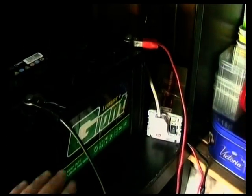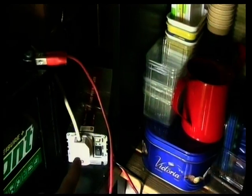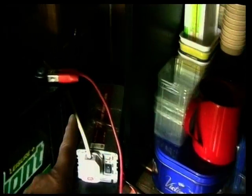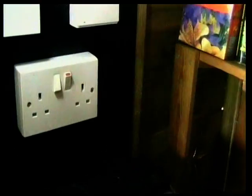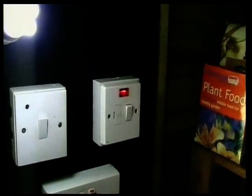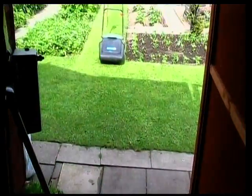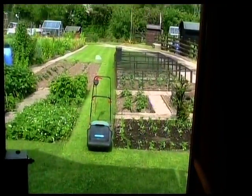For convenience, I have my battery in here as you can see, connected to the inverter. The electricity from the inverter goes into this switch panel here, and I've got a double power point there, a switch to the light, and several power points in my main shed. Then a cable runs along the ground down to the box where people see me plug the mower in.